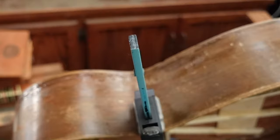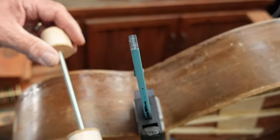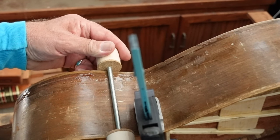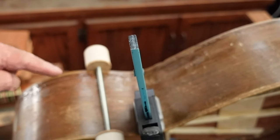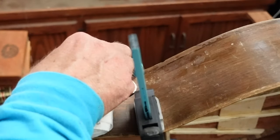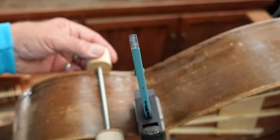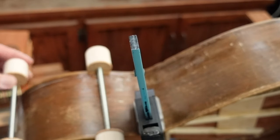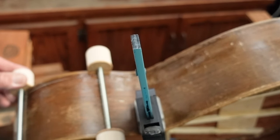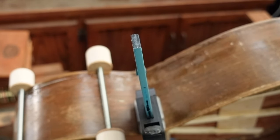Now what we're going to do is take some of these smaller spool clamps and start down there at the end. Remember, when you start squeezing things together on a big crack, it's going to want to run on the other end. I'm going to wipe this off a little bit so that clamp doesn't get stuck there, but watch, you're going to see the glue start to come up there, and I'm going to put all three of them on and get them going where I want them before I tighten them all down.